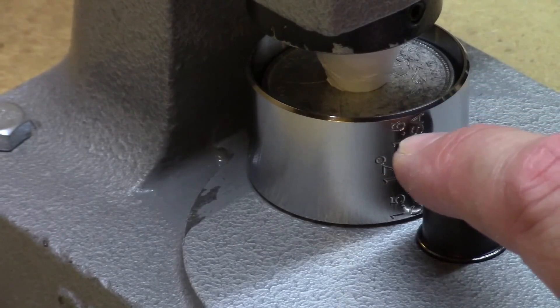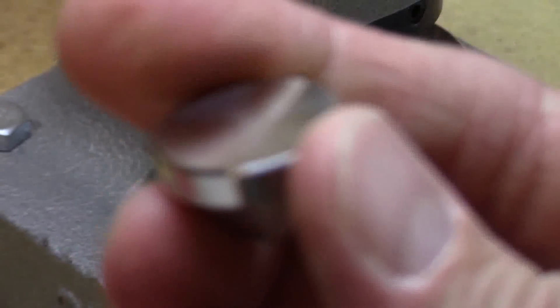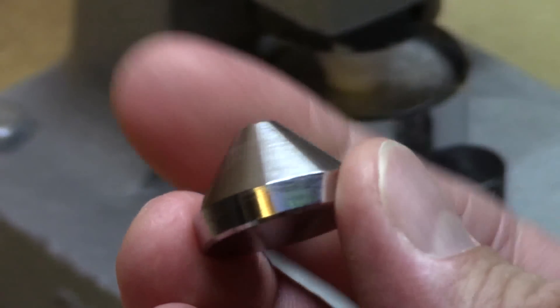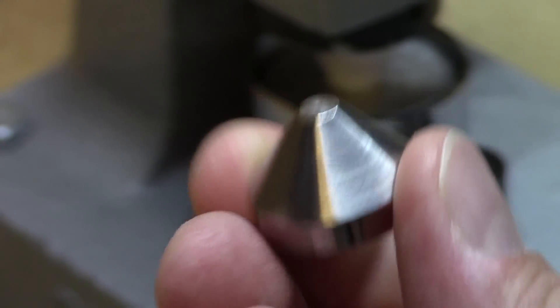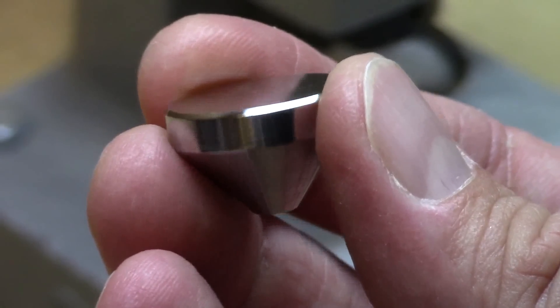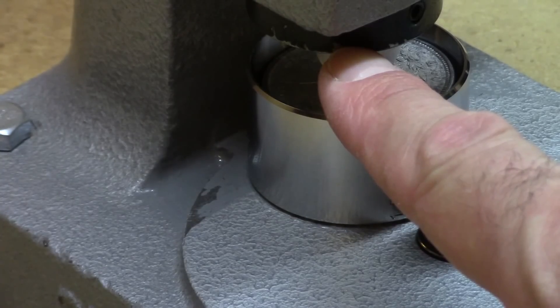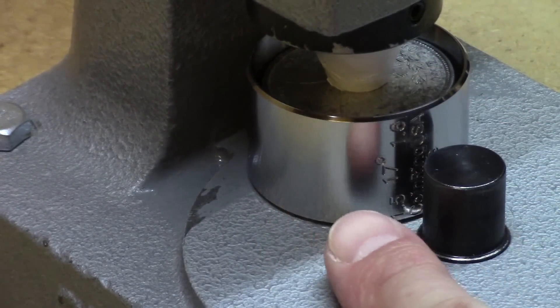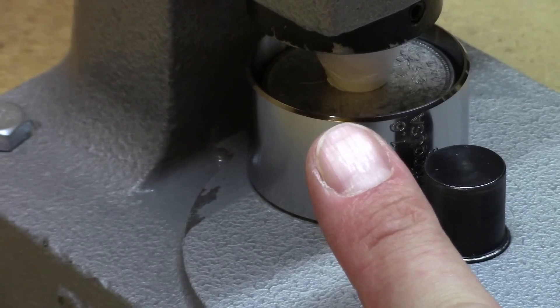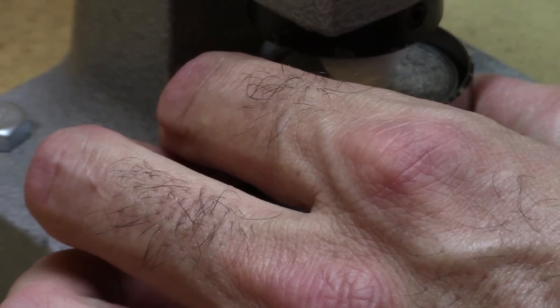I've Teflon-wrapped all of the folding cones and put the smallest one — the 3-inch folding cone — into the 1.6 side of my 17-degree reduction die, and I'm ready to fold it over. Small side note: this is the hardened stainless steel starter cone. If you have my 25-cent, 50-cent, dollar Morgan, Peace dollar, or American Silver Eagle stabilizing reduction die, this starter cone is very effective because of the low clearance on the ram head. I'm using a Durston ring sizing machine.